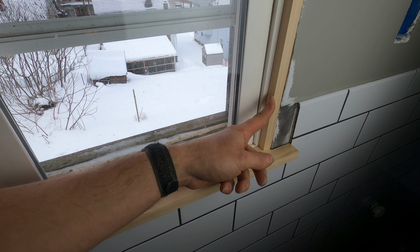I start with the lintel first to make sure the trim has the same continuous flow from one doorway over to the other. Then I nail on the two side pieces, along with the inside closet trim with 2-inch finished nails. All the masking tape is on, so now I'm ready for the stain. The color I'm using is called Red Oak. This is a Minwax product.